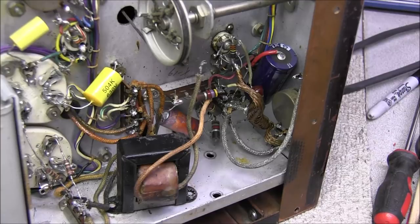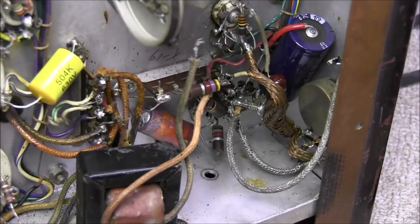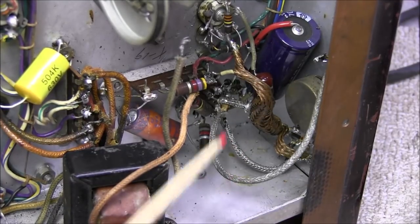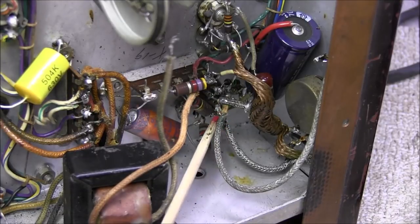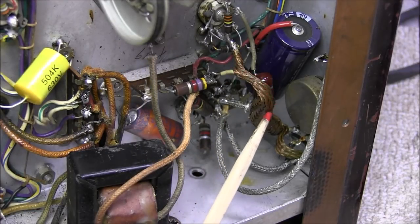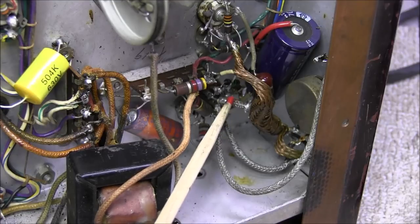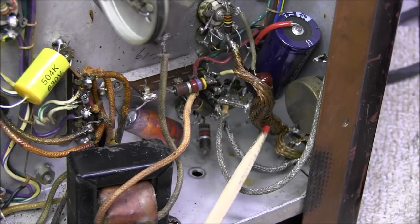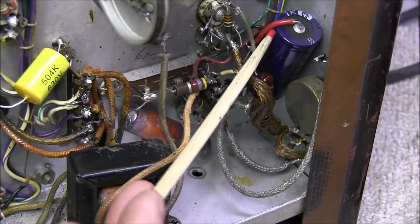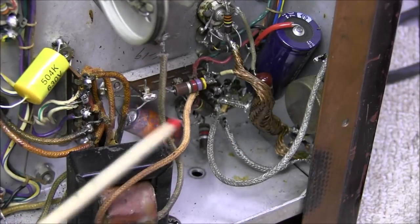Now you can get a better idea of what I'm seeing here — wow, what in the world has somebody done here. You can see this is the wire going to the mic jack going directly down to the bottom of V1. You've got this big ground strap with a wire in the center of it, and then another small grounded wire coming off going to this terminal, and then it snakes on down and goes to the audio gain pot. Then that big electrolytic with bare wires — man, it is just unbelievable. I have no idea what they've done here.